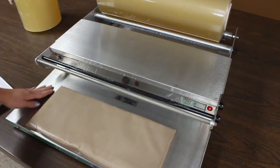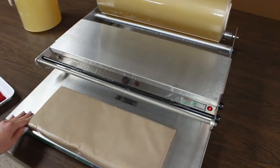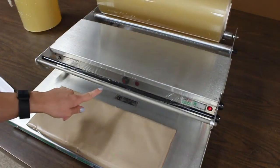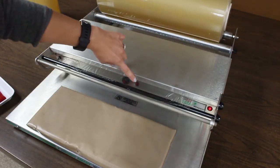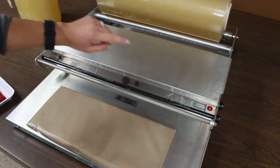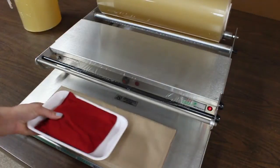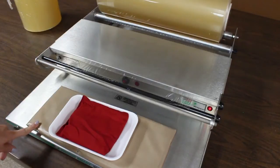There's a stainless steel front plate that is rolled in the front so that it makes it very easy to clean. This light over here indicates that the power switch in the back is turned on and the cutoff bar is actively heating. You also have a light indicating that the photo eye sees a product on the plate, and next to it is the photo eye itself. When you wrap a package and place the product on the plate, that light indicates that the photo eye sees it and the seal plate is actively heating to the sealing temperature.